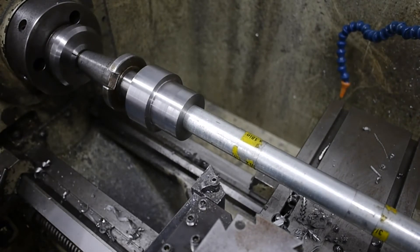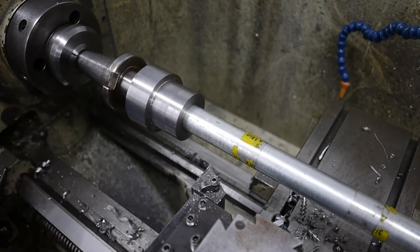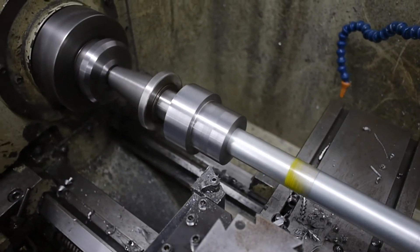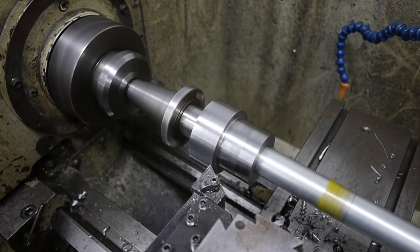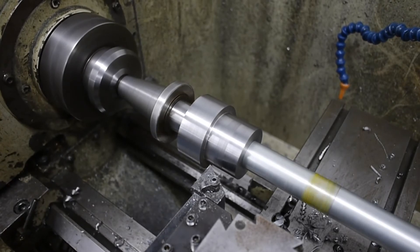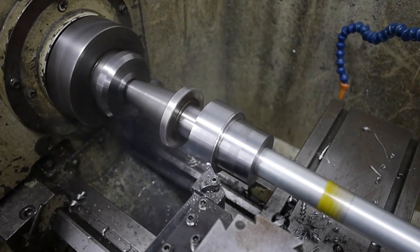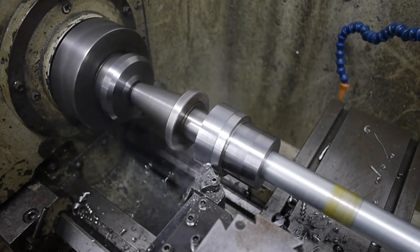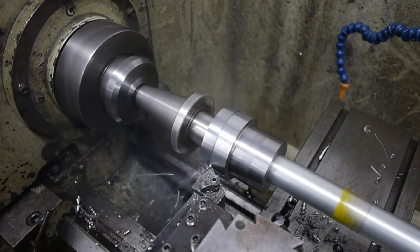We're going to take the bulk of this diameter down and get it fairly even. Right now you'll see a little runout on the outside diameter - like I said before, it wasn't critical and I haven't touched it off yet. This is a DNMG carbide insert and we're going to start off with about a 100-thou cut. I'll zero off there, feed in 100 thou, and we'll see how it does. The chip load is not too bad. I'm not running coolant for the video because it splashes everywhere - I have a pressure-type coolant, not a drip type, so it makes quite the splatter.